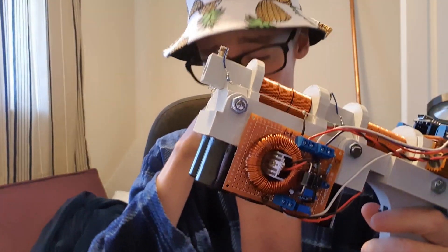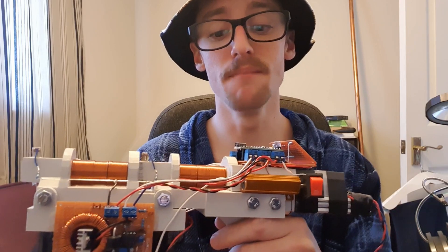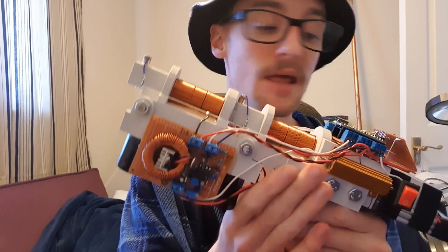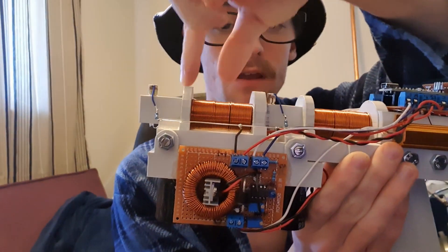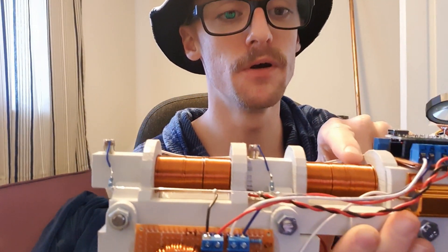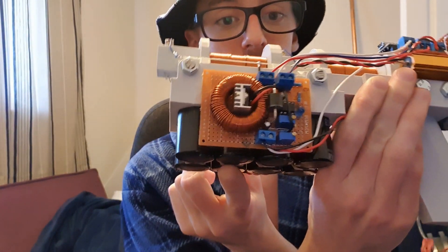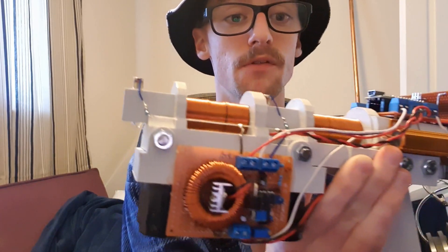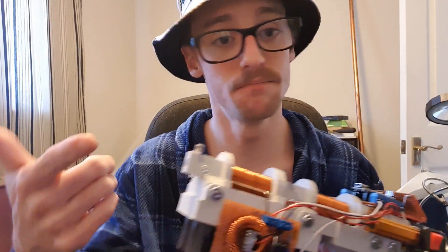This being my first real coil gun, my projectiles have only gotten up to 10 meters per second. But I've got some ideas on how I want to make a better one — this has been a great learning experience. I want a higher-voltage capacitor bank, and the big thing is you get a lot more powerful magnetic fields if you form multiple smaller coils — coils that are shorter from front to back. Additionally, it's a good idea to stage your coils so your first coil has more windings than your second coil, because since the projectile is moving fast already and the capacitor bank will be at a lower voltage by then, you want it to discharge more current with lower resistance. But I'm super happy with this, and I'll probably work on another one soon.